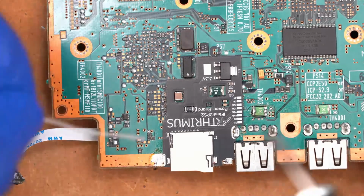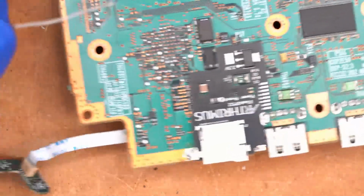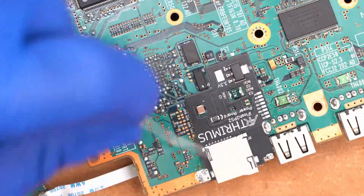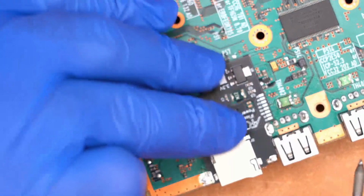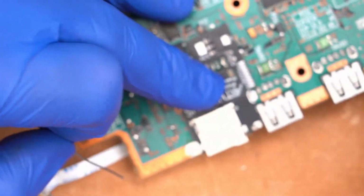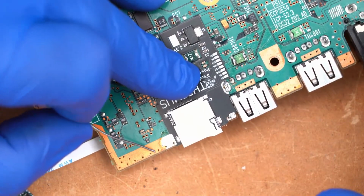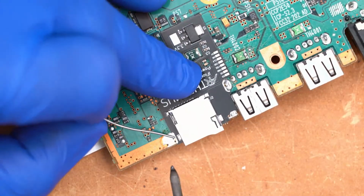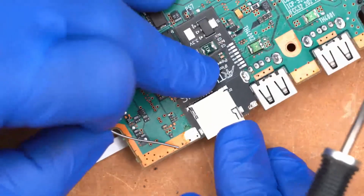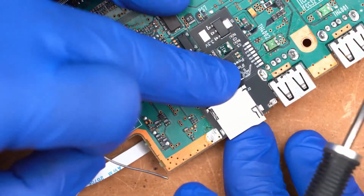Yeah, Modsville, that's what I was trying to accomplish, getting the connection to those resistors easier, because I noticed, like you and I were talking about, a lot of the other flex cable designs only have copper on the top side. They don't have through-hole pads or castellations or anything. And that does seem like it would be really tricky to get a good connection because you're basically just creating a bridge. So I think this works pretty well. So far, I'm pretty pleased with it.